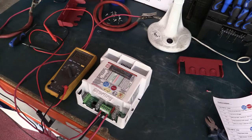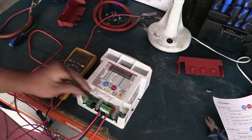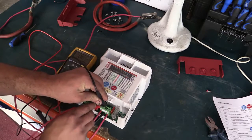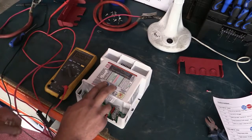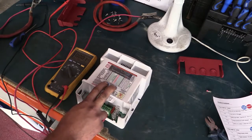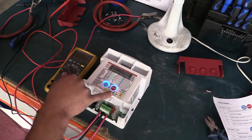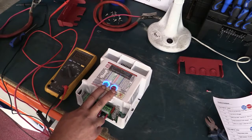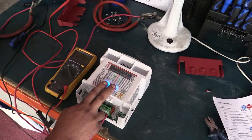The first method is quite simple if you have a mains battery charger installed on the vehicle - increase the input voltage up to about 14 volts. On my power supply I'm turning it up to 14 volts, and you can see we're now at 14 volts. When we press the buttons, the microprocessor picks up - you'll see it flash blue and the buttons become illuminated, meaning they're awaiting the next instruction.